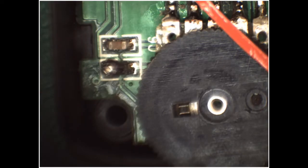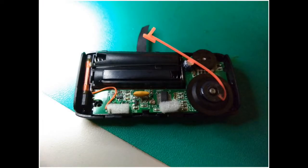The only kind of bad thing I found was a couple of spots where it looks like they may have hand-soldered. Right here is an inductor that looks like it got a big glob of solder on one end with some flux residue up there by what I think is the volume wheel or tuning wheel. But other than that, the inside of the radio looked pretty good as far as assembly went.